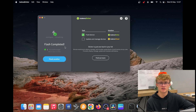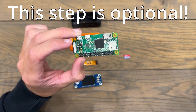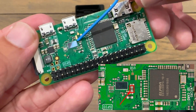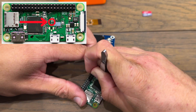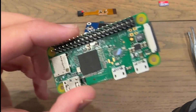Now we can go ahead and actually build the device. Before we start, let me mention that SeedSigner is fully air-gapped, meaning there's never a need to connect to Wi-Fi or plug the device into a computer. However, my Raspberry Pi board does have Wi-Fi capabilities. To ensure it can never connect to Wi-Fi, I'm going to remove a part from the board. I'll leave a link below showing the research done by DT, and SeedSigner verifies it works on Twitter. This little part here needs to come off to remove the Wi-Fi capabilities.